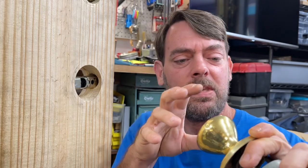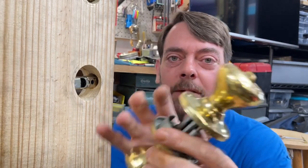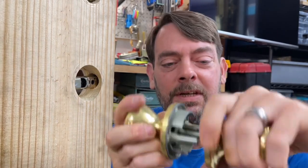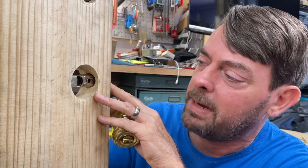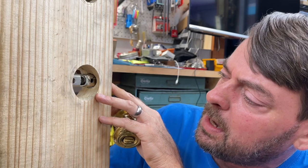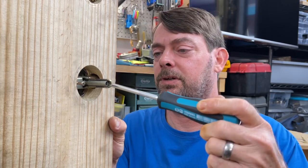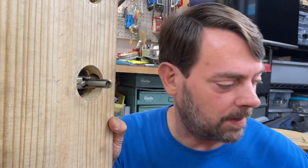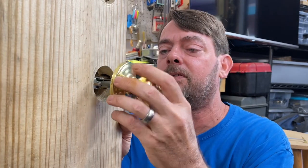As you're tightening it down, you need to hold it as tight as you can. This isn't a great system — ever since they introduced it, if it gets a little loose and somebody twists it to open the door, it can come off. When putting it back on, go straight through. These screws need to be pretty much perfectly straight — if one is longer than the other, it makes it hard to get back on.